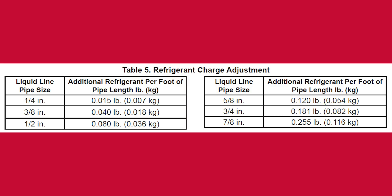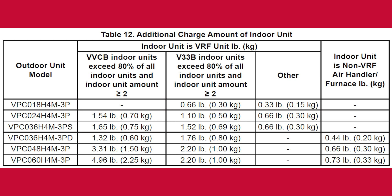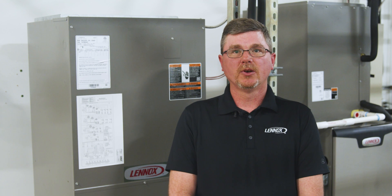If you need to calculate your own refrigerant charge for any reason, the table in the installation manual will help. First, measure your liquid pipe and using the table to identify the pipe size, multiply the pipe length by the amount of additional refrigerant per foot. Next, if the ratio of VMDB or V33B indoor unit capacity exceeds 80% of all the indoor units, use the table in the manual to determine the additional refrigerant charge to add. Then calculate the additional refrigerant charge for each liquid line branch pipe kit. Total all calculations and charge the system.